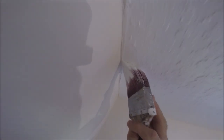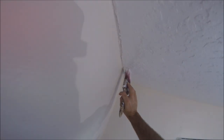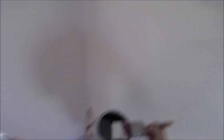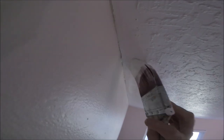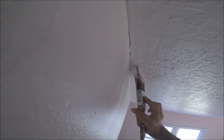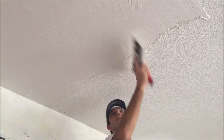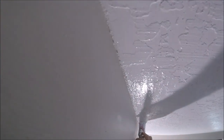This cut-in will be dry by the time I'm done rolling. After cutting in, just start where you started with the caulk, get the bead out away from the corner, and work your way in. Believe it or not, this is a painted popcorn ceiling that I did two skim coats over and then did a skip trowel texture. And now I'm priming and painting. I'll leave a link in the YouTube card above to the playlist where you can watch all these videos.